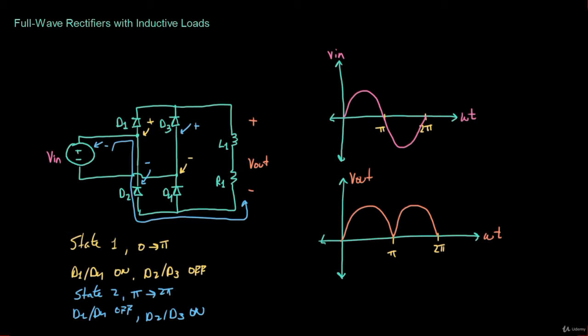The peak of the output voltage is the same as the peak of the input voltage. If the input has a peak magnitude V, then the output peak is also V. The DC component of the output current is going to be dependent only on the output resistance. The output current will fluctuate, and the amount of fluctuation — the ripple — is dependent on the size of the inductor. The average of the output current equals V over R, but the ripple depends on the inductance.